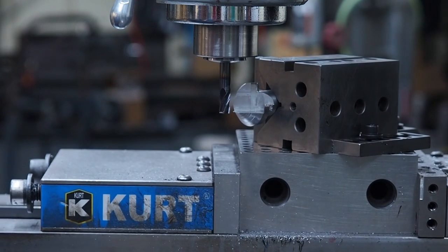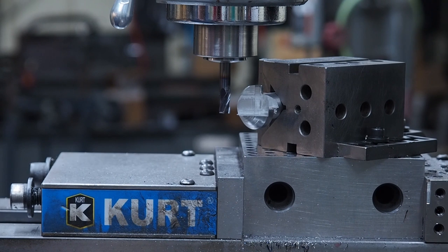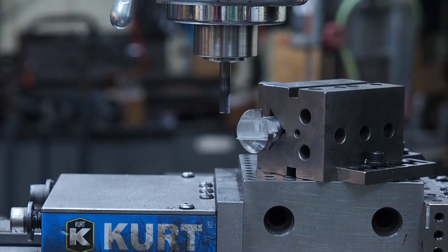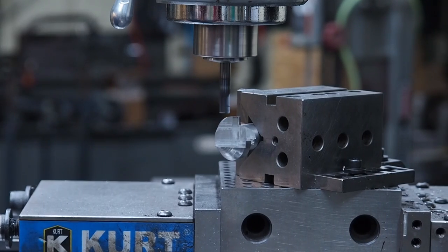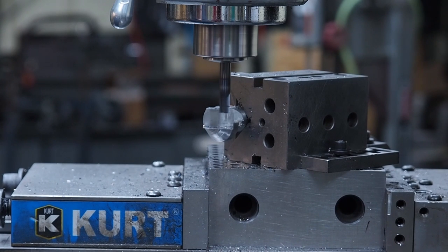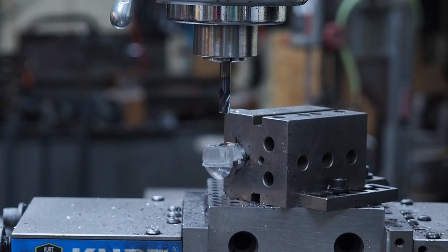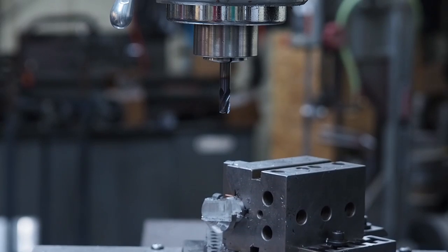What I'll do is over here now, because I stopped at zero, I'm going to go 156, 156.2. And set zero on that axis. And while I'm at it, I'm going to go ahead and knock that top off because I got my reference for the 10-32 screw in here already. And we'll just leave it like that. And just getting rid of extra material you don't need. You can see by the time we put the pocket depth in there, that 1/4-20 screw that I had in the end, it's all gone now.